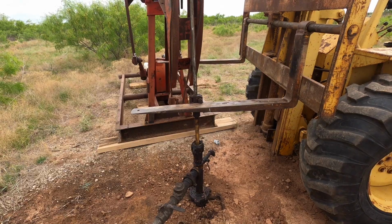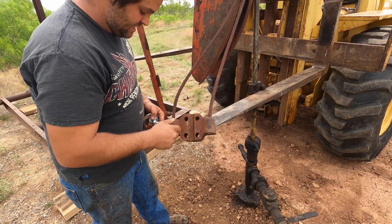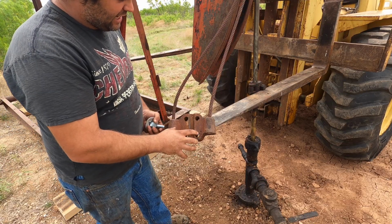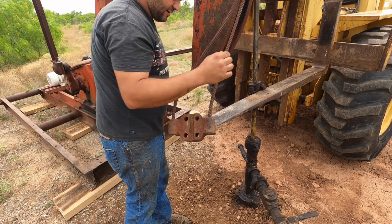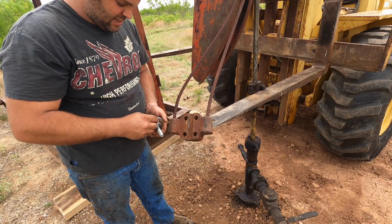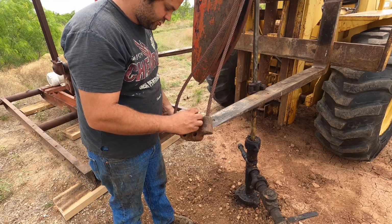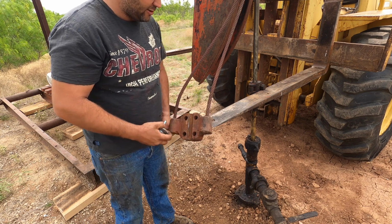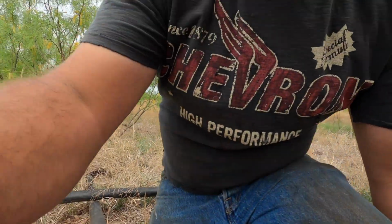All right, is that not the sketchiest thing ever? To be honest, I hate these type of bridles. They originally had a big casted piece, and they were sort of supposed to be used like the clamp, and this clamp onto here, but they're not strong enough, they don't work, and they usually bust and split here. And so what everybody ends up doing is taking a stack of giant washers and putting a bolt back here, and the big washer basically holds it on here. Let me get you down here where you can see. I hope this don't come loose and cut my finger off.